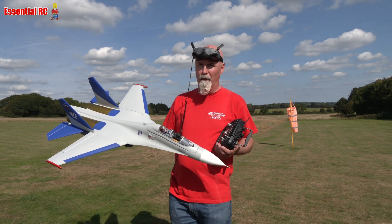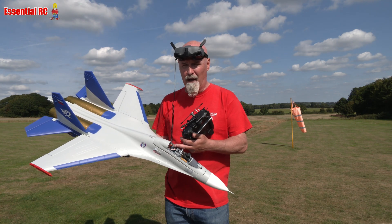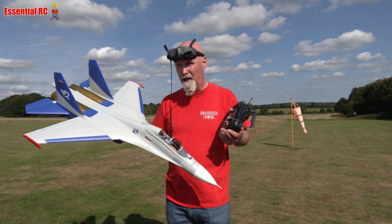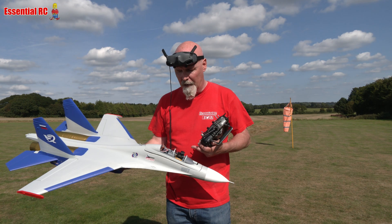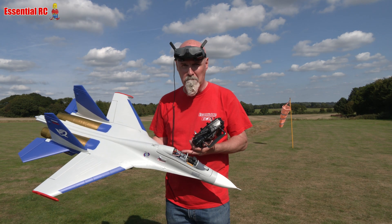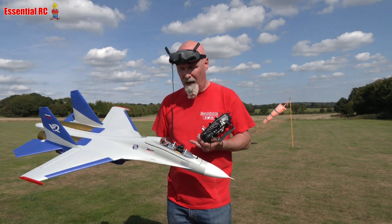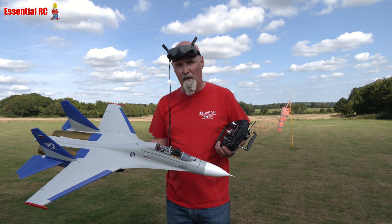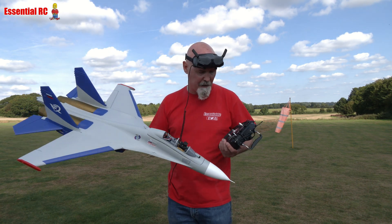So you have to do that, plus then you have to load iNav onto it and then configure iNav. I have done quite a few flight controllers with iNav, so it wasn't too difficult. The benefits are that if you use the flight controller, you get telemetry on the OSD in the goggles — your height, altitude, speed, distance from home, a vector arrow back to home, all of those things. Plus you get gyro stabilization and return to home, loiter to do a circle at altitude. You get a lot of benefits from using a flight controller, but it triples the complexity of this type of project.